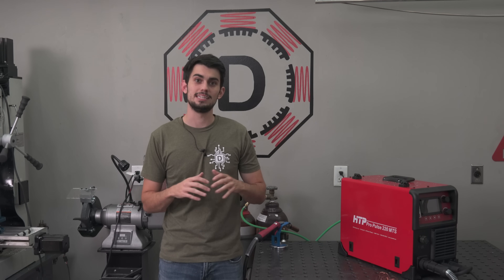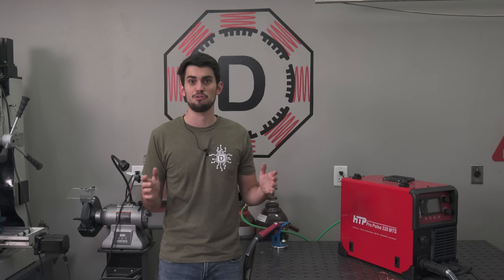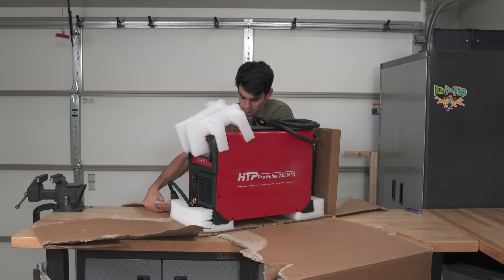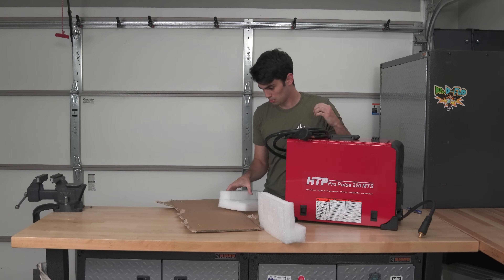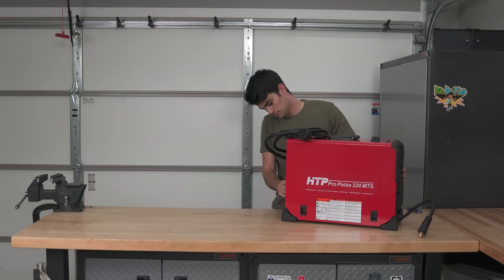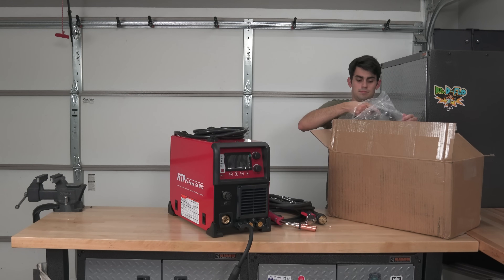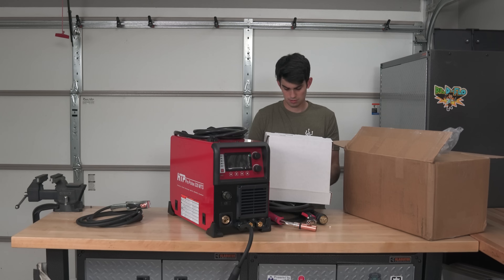With all the beer caddy pieces cut out, it's time to weld them together. Up until a couple weeks ago I had never owned a welder before. I'm very excited to announce that the Dr. DeFlo channel is partnering with HTP America. HTP sent out their new Propulse 220, a multi-process machine capable of MIG, TIG, and stick welding. I had to admit to HTP that I am inexperienced when it comes to welding — I have a little experience with my buddy's TIG machine but that's about it. One of the most compelling features of the Propulse 220 is its ability to do Pulse MIG, and I have never MIG welded before. So HTP scheduled a week-long bootcamp to put me through the paces of MIG welding, and the goal is to translate what I learned into a how-to Pulse MIG weld video. I'll be welding with 0.030 steel wire, and I picked up a tank of 90% argon and 10% CO2. A higher argon content is required because the spray arc needs a hotter gas. I set the material thickness to an eighth of an inch — this is a synergic machine, so it should adjust all the parameters automatically so that even a rookie like me can get started quickly.